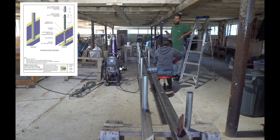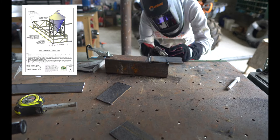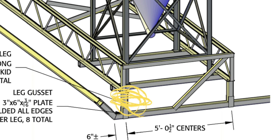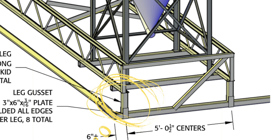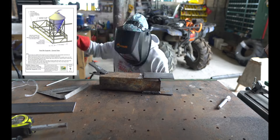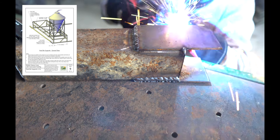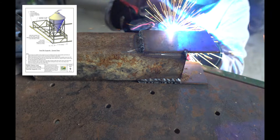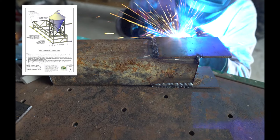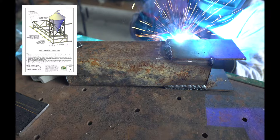For example, ours are every four feet. You'll want to make sure they're square and plumb when you weld them. Next, we're welding up what's called the grain bin support legs. This will support the main truss structure on the back of the open coop. We're using three inch by three inch square tube stock with some three-sixteenths flat plate. The sizing and dimensions can be found on page nine. We're using the flat plate to add more welding surface area, so it will cup onto the bottom of your base frame and give you a lot of support and welding surface area.